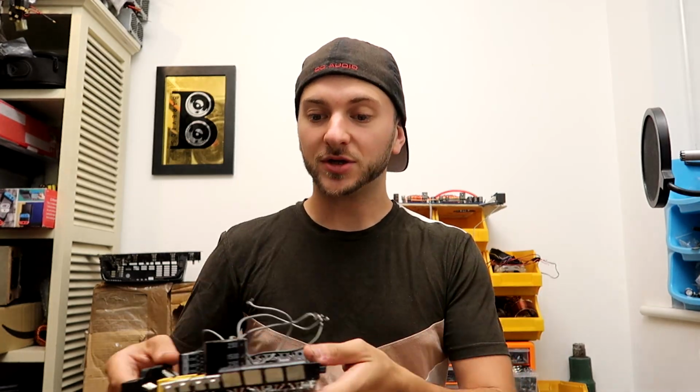So going forward, in order to do that, I want to discard all of that temporary winds on the transformer, and I want to wind the transformer up with the final high quality wire that we're going to be using. And I worked out roughly the amount of turns that I need for around about the 200 volt rail limit, and it will change with 12 volts or 14 volts, but around about the 200 volt mark I worked out the rough length of wire that I need.